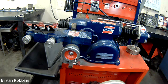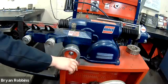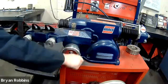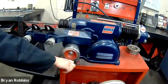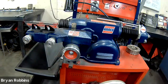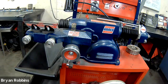We're going to start off today by getting familiar with this piece of equipment. A few things you should know about how it works and operates. We'll take a look first at the cutting head. The cutting head moves inward and outward by turning this handle, and typically we're only going to be making any adjustments when the machine is actually running. You would not be moving any of this in or outward until you have the brakes set up and the machine is turned on.